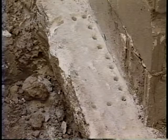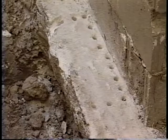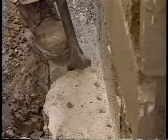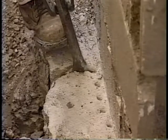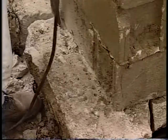From the first and last holes, drill holes perpendicular from the wall every two inches to the edge of the footing. After drilling all of the holes, use a jackhammer to break out the section of footing that was drilled. Jackhammer one of the perpendicular sides and then the other. Finally, jackhammer along the holes next to the foundation.